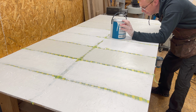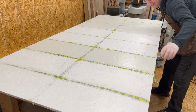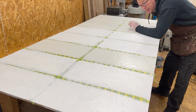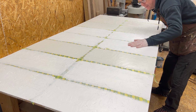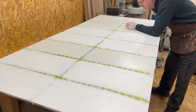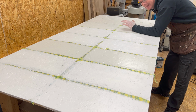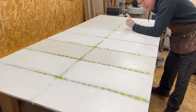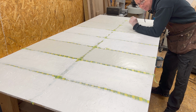Yeah, coat on, plenty of time to dry. Oh, one last thing, I did notice yesterday, the oil-based primer takes a lot longer to dry. And I mean as in hours longer. I came back last night and the Zinsser stuff dries really quickly, and this stuff 4-5 hours later was still a little bit tacky to touch. So if you're in a bit of a rush, be mindful of that one. You need to give it plenty of time to dry. Right, let's crack on.